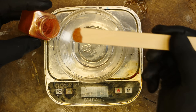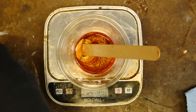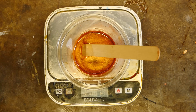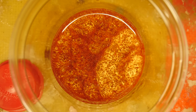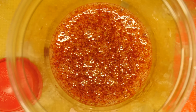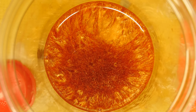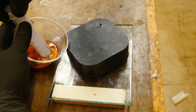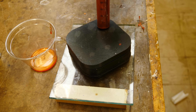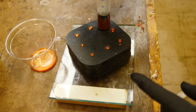We'll use some more clear resin. In this case I'm going to use a bronze Arteza mica — I'm changing the mica slightly because I want to tint it a little bit different than before. It was a little too coppery, so I'm going to go with more bronze. The beauty of this material is you can use a different durometer and different color to match something else — a way to speed up the process for your color, material, and finishes projects. I've cleared out the other vent holes, so hopefully we're going to get a slightly better part. It looks like the resin's coming out of all the vent holes, so it looks like it's going to be successful.